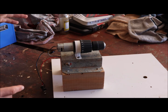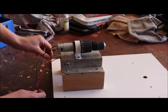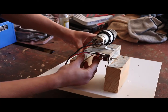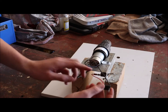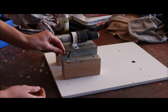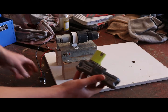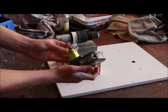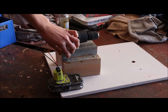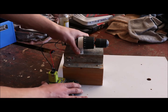That's the first stage done — the motor bit. I've got the drill motor here with two wires coming out the back. One of them I've taken and wired to a switch underneath, then brought the other one from the switch to a little clip — the battery clip from the bottom of the drill. So you can just take any old drill battery, clamp it on to the switch, nice and secure, and turn it on. That's pretty much all you have to do — just have a motor you can turn on and off however you want.